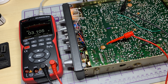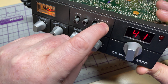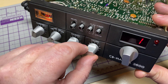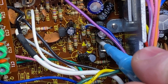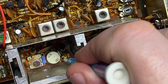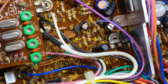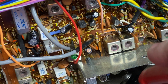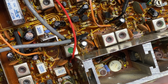Shame these PLLs are getting a bit hard to come by, but we do have replacements, and if we don't we can always use a 145158. This is still confusing me because all the bands are right but the 41 to 80 is wrong, so it looks like it's been wired up wrong - we'll link it out anyway. So let's do some performance mods: audio limiter to 5.6k, R44 needs to be a 15, and this one needs to be a 33. We'll get rid of those components.